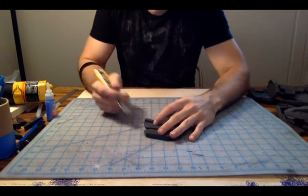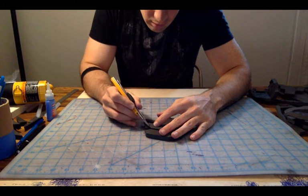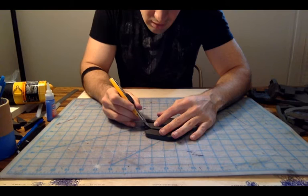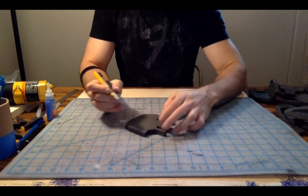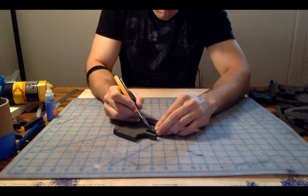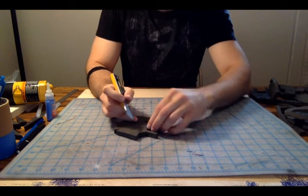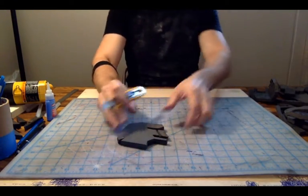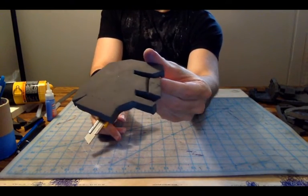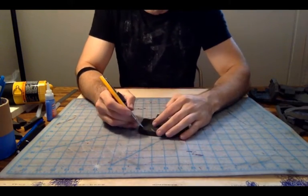Right, and in the middle here, I want just under a quarter of an inch cut. So a little over an eighth of an inch on this here. Show you what I mean by how wide the cut is on this. Cutting this little V channel. Nothing crazy. Just that much on there. Okay? Right about there. Alright, the back side here, I've already marked this off.